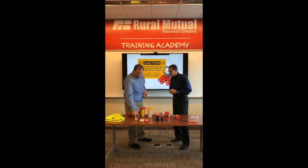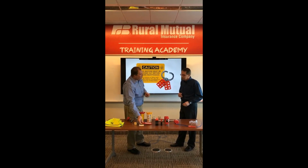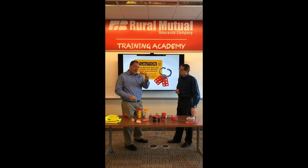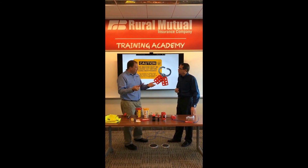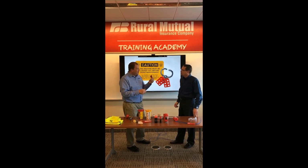Absolutely, and we talked a little bit about gang hasps as well. You notice some of these have multiple holes that are on them. So if we have more than one employee working on it, each employee has to have a tag or padlock on that device. So we could lock it out with this hasp device, and you could have 6 employees put a tag on there. Or you could add more onto here and add additional employees as needed, so that every employee that's working in harm's way has a lockout device that's on there.